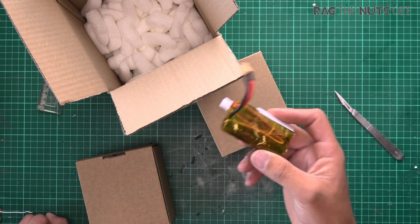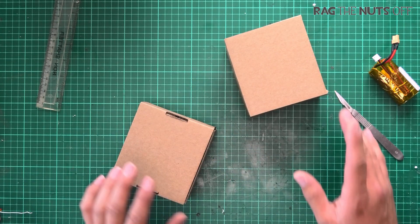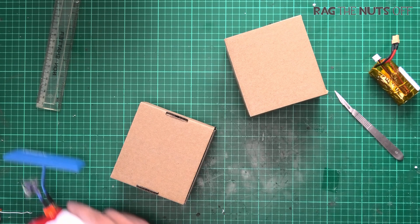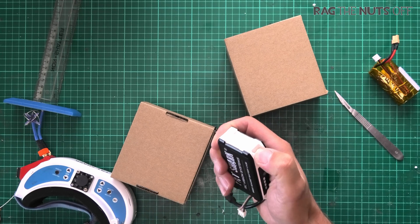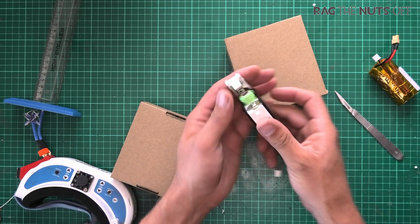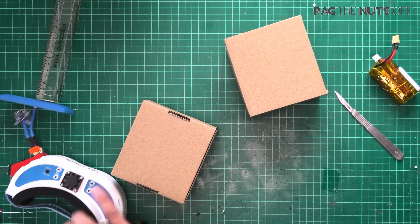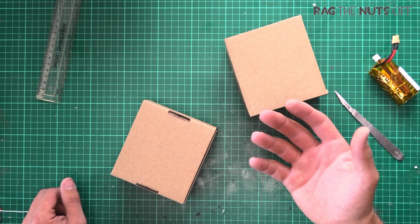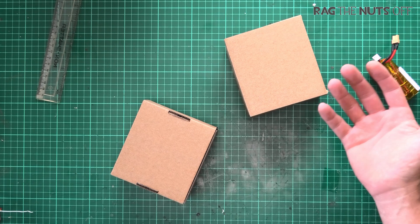That's what I'm using for inside of models - I've used Li-ion batteries here for absolutely ages. Let me grab the goggles because that's where I had been using them the most. The Li-ion batteries are great because the fat shark batteries which I had were just dying every two minutes. You'll notice in there that's the 18650 batteries inside the fat shark goggles, so I didn't have to change my goggles every five minutes. The nice thing about 18650s is that they are more power dense compared to LiPo batteries.